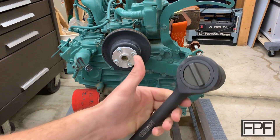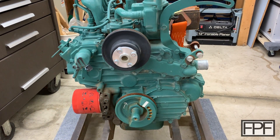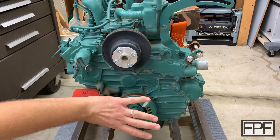It is a three quarter socket wrench to drive this — this is huge. I'm going to go ahead and put this in. I did a little arrow here in paint marker just on the pulley to make sure I knew which direction this is supposed to turn from the water pump side. It's supposed to go clockwise.